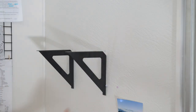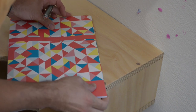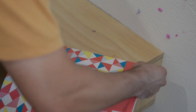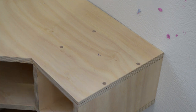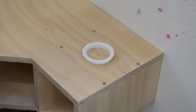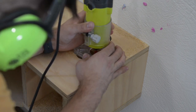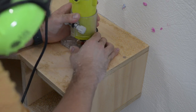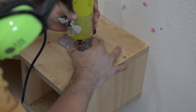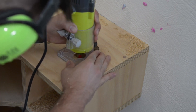I was at Ikea recently and I bought this wireless charging pad — it's called Nordmark, but I put it in a translator and it meant North brand in English, which I thought was pretty boring. As before, I didn't have the right size hole saw so I drilled and used my trim router to make the hole just big enough to fit the external ring into. To locate where I was going to put my hole I measured halfway in between my dowel plugs. I really like the ease of using a recessed wireless charger. The problem with hidden wireless chargers is that you lose a lot of charging speed due to the thickness of the surface you're mounting it under. With recessed ones you lose no charging speed, and if the charger is nicely designed it really isn't an eyesore and it can be a nice added feature to any table or desk.